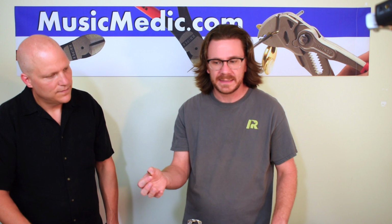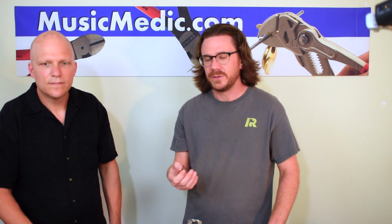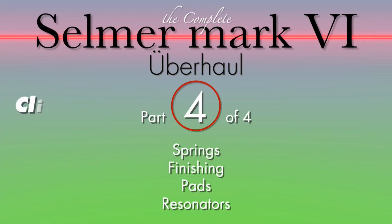And then I drill and tap either end. I turn it down, and by using square stock, it looks similar to a stock octave rocker. That's the goal anytime we do modifications: it should look like it was always part of the horn. If it looks weird and sticks out like a sore thumb, then you're doing something wrong with your modifications.